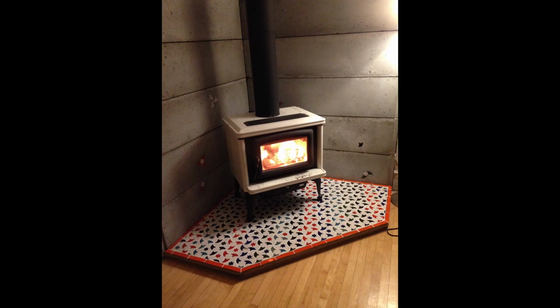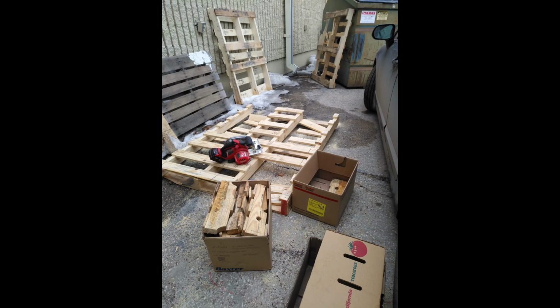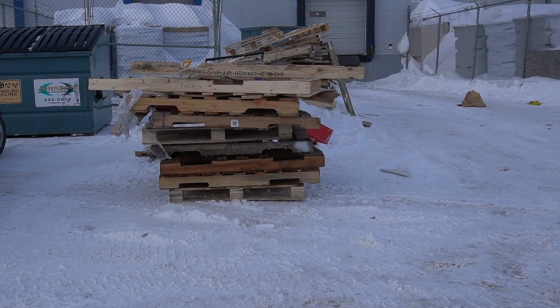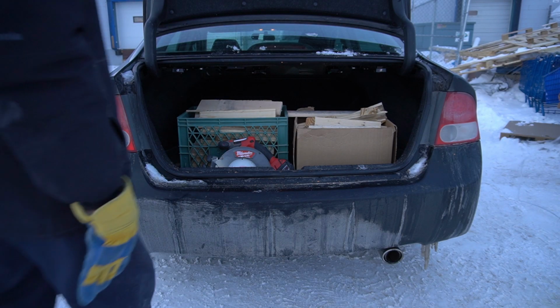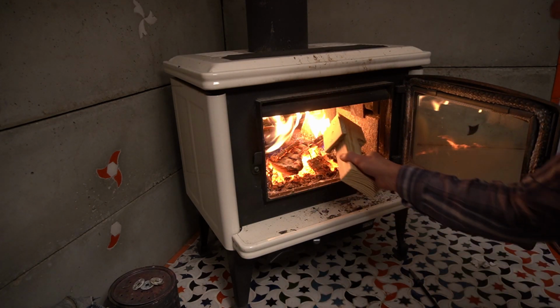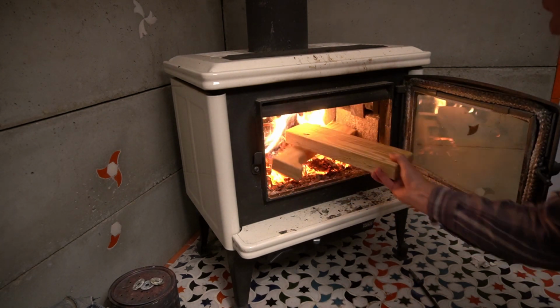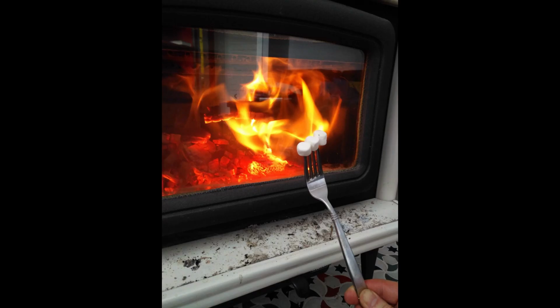It is really so nice to cozy up to a fire every day in our excessively long winters. The wood stove setup is interesting in 2 ways. One is I burn scrap wood that normally would be going to the landfill, so I get some serious points for that. That means I scout with my trusty battery skill saw and cut broken pallets and bring them home. No garbage trucks are now hauling these to an uncertain future at the landfill, possibly making methane. The other thing is that I am of the burn it fast and hot school. Why? Best combustion. The most efficient conversion of wood to heat is by burning it hot. A slow burn produces creosote and VOCs that all your neighbors can smell.